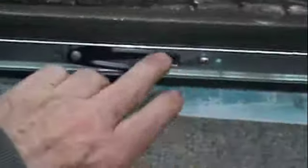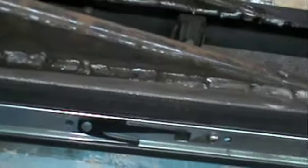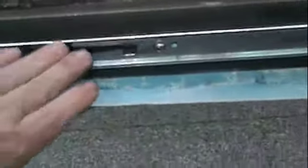One continuous bead would have put an awful lot of heat in there, melted my plastic clip, and possibly warped the damn thing. Even though it's an eighth inch thick, I didn't want to distort anything or put any bind on the tracks if it did warp.